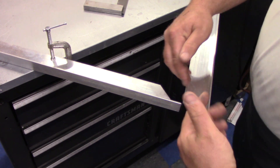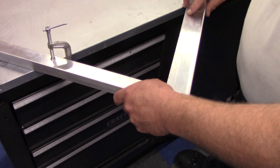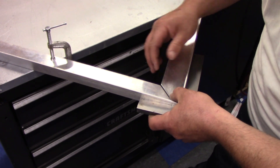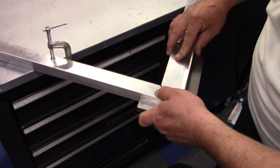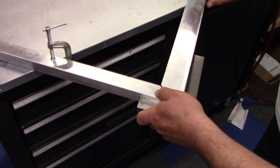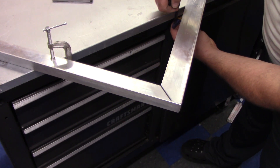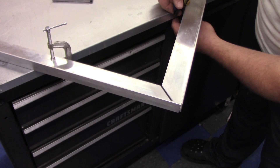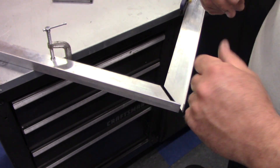As far as accuracy goes, I just cut these 45-degree angles with a miter saw, so they're probably not going to be perfect — it moved around a little bit as I was cutting it. Nature of the beast. All we're going to do here is eyeball up this inside edge and get these so that I don't see any gap. We're touching here, we got a little bit of a gap in the middle, but it is what it is. I've purposely got this hanging over the edge so I don't have anything acting as a heat sink. Let me get a better clamp and we'll come right back.